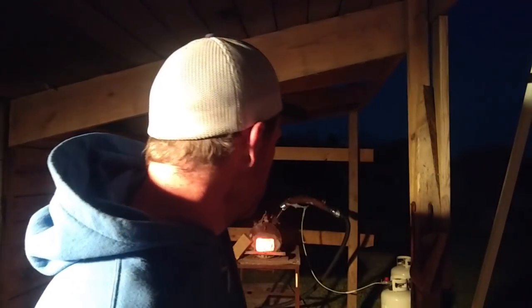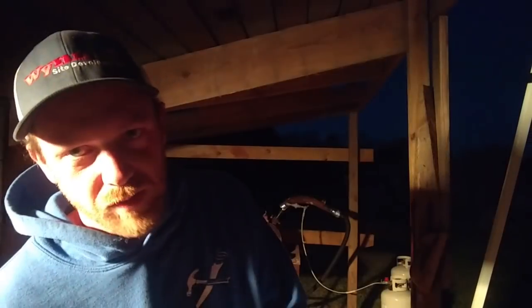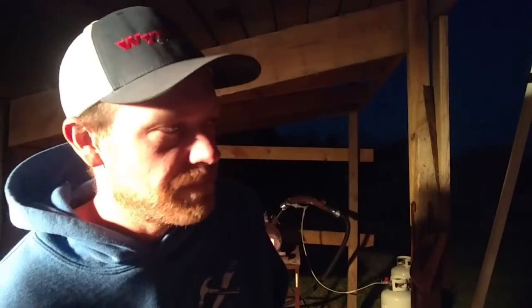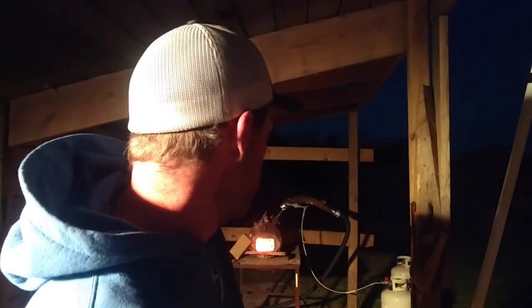Get some refractory. Make sure that your refractory is rated for 2300 plus degrees if you're going to be doing any forge welding, as well as your K-Wool. I use 2-inch K-Wool and Satanite refractory. Works great for me. Put it on good and thick and it'll last you.